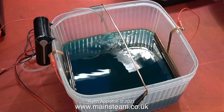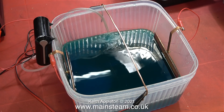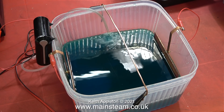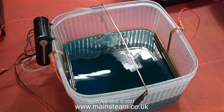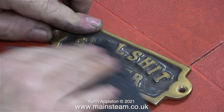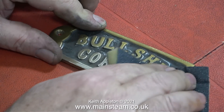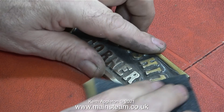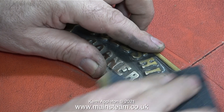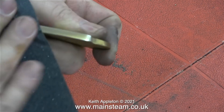It's really nice to have some bench space again. The air stone is bubbling, the electrodes are in position — all I need to do is find something to electroplate. In the outer part of my workshop I found this: I received it as a gift from someone years ago, it's made from brass and it's quite tarnished. The first thing to do is clean it up. I'm just testing my acid bath so I'm not taking too many pains, but I really should use the polishing spindle and get a finish I could see my face in — because the smoothness of the electroplating is relative to the finish of the metal underneath, since the deposited copper will follow very accurately any hill or valley on the parent metal.